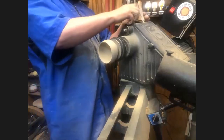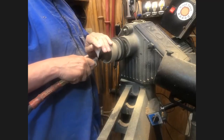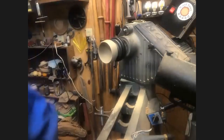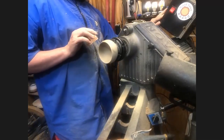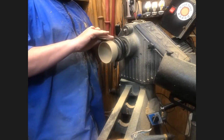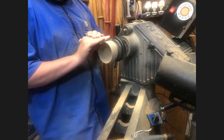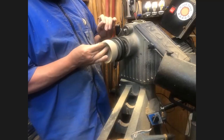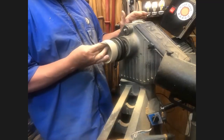Toothbrush works great too in place of it. My goal with my cuts is to start sanding no lower than 220. So sometimes I can get there. The only issue you have with that is if there's anything in that wood, you're not getting it out. You're leaving it. If you have a burnish mark, 220 is not going to typically take out a burnish mark. Right, but my point is if you've got a good clean tool cut, then you don't have to do it. You know what I'm saying? I got you. Yeah, no, you're right. I'm not arguing at all.